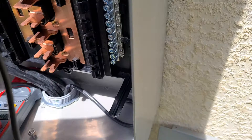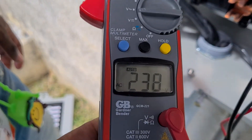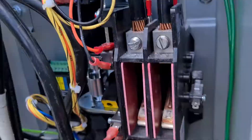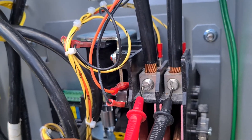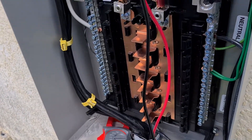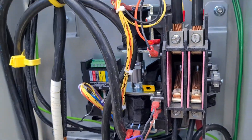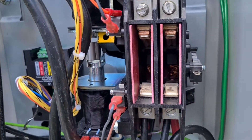On E1 and E2, which we call off the grid, we have 238 volts right there. Let's put it on N1 and N2 — zero. Zero, no utility. So I'm going to turn on the power and she will transfer up. Alright, as you can see, it's on utility now.